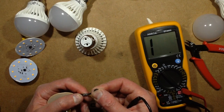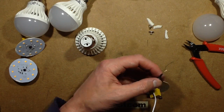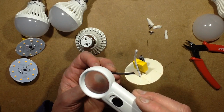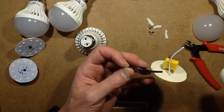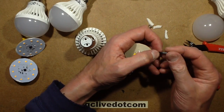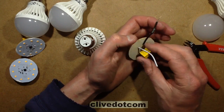Not very easy reading the colour code, largely because I've scraped it, and it's a very dark background. I've always found resistors with dark backgrounds hard to read. Actually, it's yellow-violet — 4.7 ohms, yellow-violet-gold. I've always found carbon film resistors the easiest to read because of their warm coloured background. With metal film resistors like grey or blue, the colours can look so dark they're hard to differentiate.